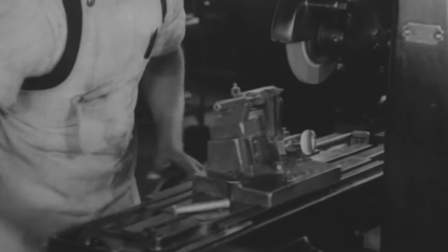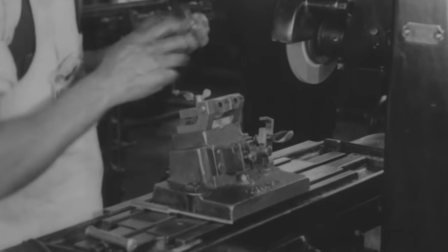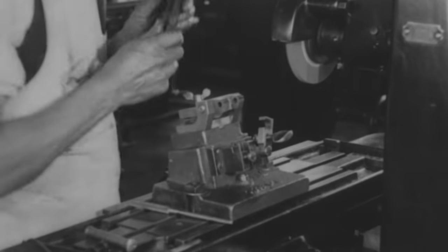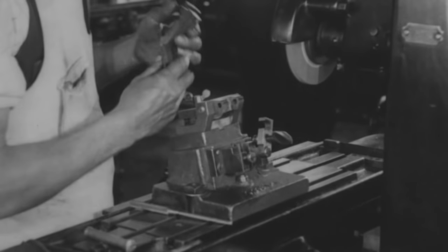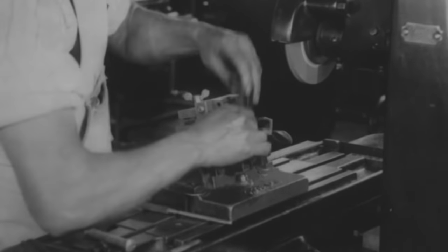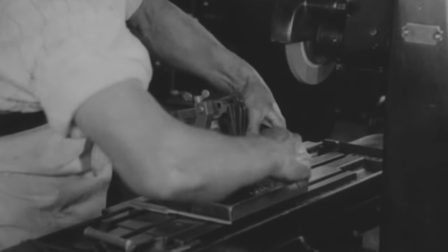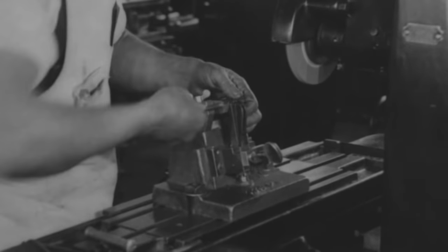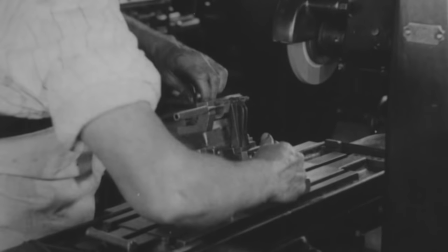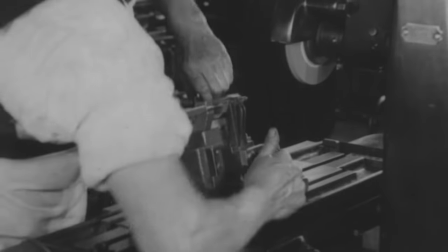Yeah, and the other thing it's often worth pointing out is what you're not seeing, which is measuring. It's all done on jigs, and then someone at the end would check them against a go gauge and a no-go gauge for every single piece. And normally there'd even be sets of master gauges because gauges wear out. They'd have gauges for the jigs, gauges for the parts. So there'd be working gauges used on the factory floor, and then a set of master gauges, because they'd have to constantly be making gauges. And it was, I mean, toolmaker is a role.